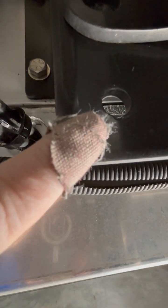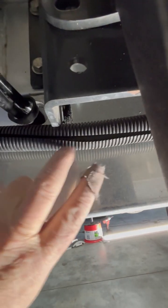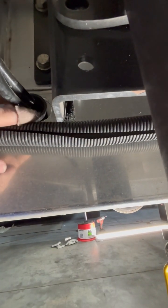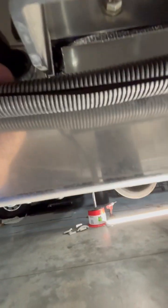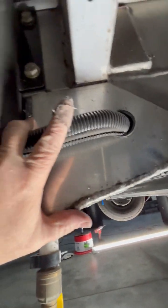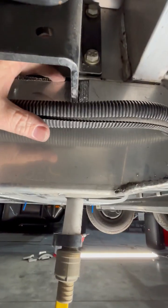So if you guys wondered about the jacks and stuff, if you look through that hole, you can see that insulation all smacked up against that. You can see the insulation all completely smacked up against all that and inside there. So I'm going to come back in here and put a little bit of that Great Stuff in that hole there. And you can see that when I put the insulation in, it just popped this out. But I mean, you can see the insulation right there, right? Probably going to put a little drop of Great Stuff in there, let it expand out, put a little shot in there. And again, another little shot right there, but you can see that insulation right against it, right? And I'm pushing on it. I'm not really going to push that away. And then it matches all up in here. I don't even know if I can get that picture for you, but yeah, there you go.